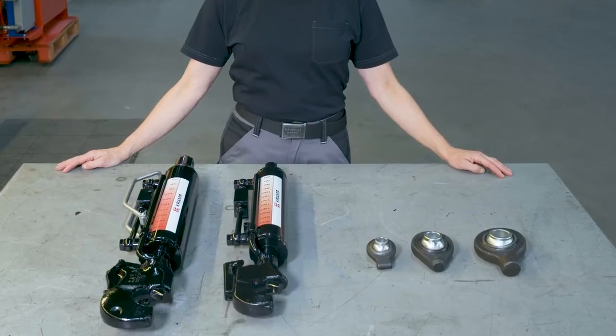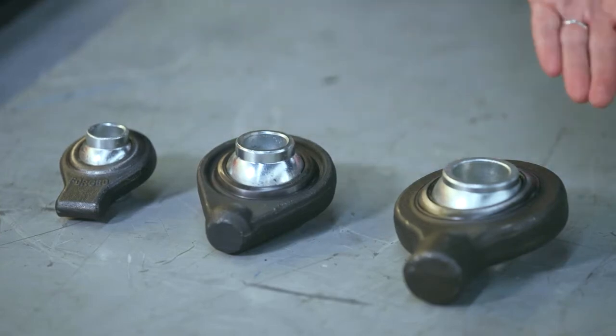There are many different kinds of ends, all with their own characteristics. The end of the cylinder that connects to the tractor will usually be a ball end. On the other side of the cylinder, on the machine side, you'll usually find a quick attach hook. They're ideal for swiftly connecting and disconnecting different types of equipment.